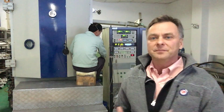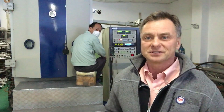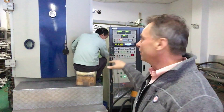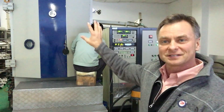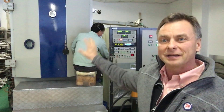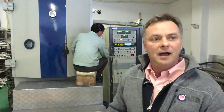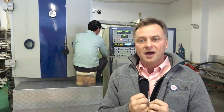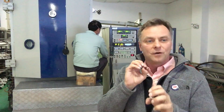Explore Scientific's EMD coating — enhanced multi-layer deposition coatings — are done on machines like this. This technician is controlling the vacuum chamber. Inside that chamber is a cluster of our optics that are rotating, and underneath that cluster of all the optics is the ion beam gun.